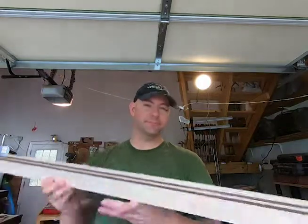Okay, so I'm really glad I took this to the jointer before I went through the sanding process for leveling, because there was kind of a twist that was glued into place, and it would have just made it worse if I went ahead and leveled the faces before I jointed and established the flatness of one side.